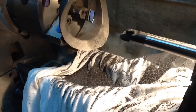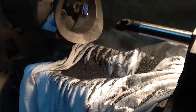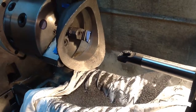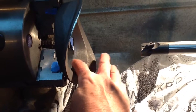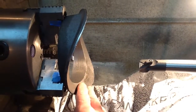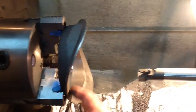I've just finished machining this one out. You can see I put an old t-shirt over the lathe bed so that I wouldn't get all the cast iron nodules in. It turned very nicely — it's beautiful. I wasn't going for any kind of a great finish there, just trying to get the thing opened up so it would fit over the steam dome, and it's quite a big opening.